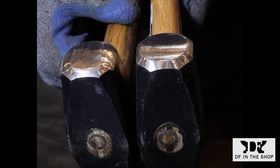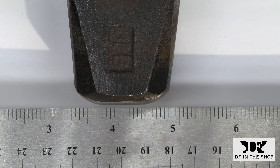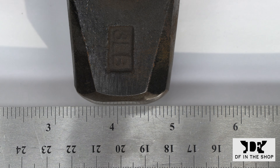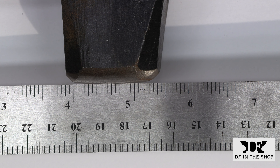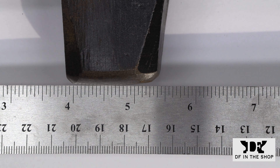The hammer on the left shows how I grind my hammer faces. This view of the hammer head shows the main striking surface — directly above us is the hammer handle, with the very end of the handle pointing directly at the camera. You can see how the hammer is divided into three separate areas: the center is left essentially flat for hammer refining and driving tools like chisels and punches, while the outside edges are radiused for fullering. When the handle is laid on its side, you can see how the flat center section extends across the entire face with only minimal radius on the two outside edges.